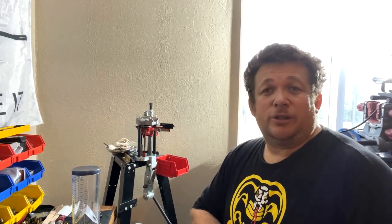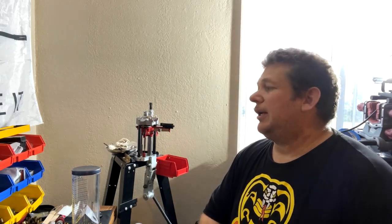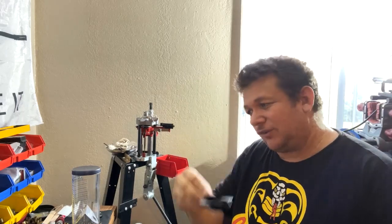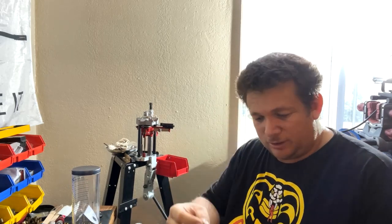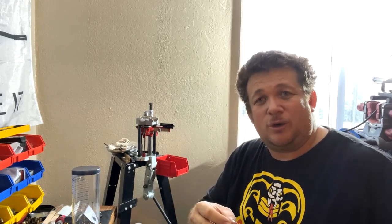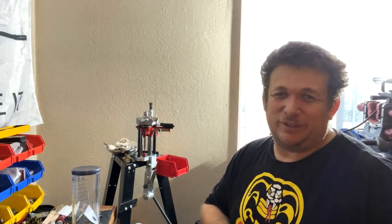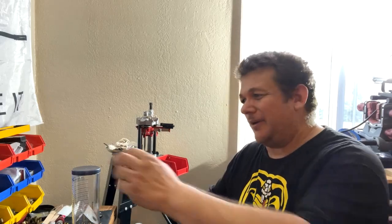The other thing you want to do is make sure you don't have a double powder charge. A really big deal on that is, say I have this and I run a second charge. Now I've got a second charge in here, and this is going to weigh out at 12.7, 12.8, which is not a good thing. You want to get that out.